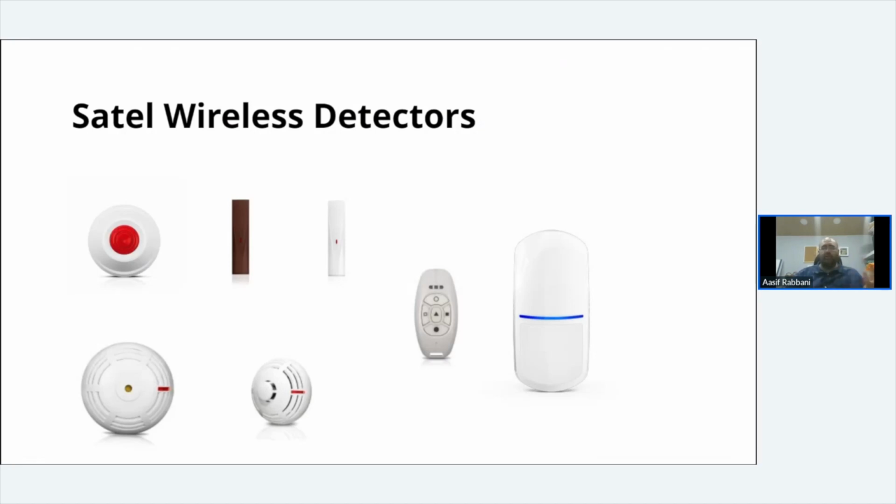So say, for example, you put in a Slimline pet and the customer kept having false alarms because it was in a room with a log burner or a heater or something that gave off heat after hours. Then you decide, I need to change it. Instead of changing the whole thing, you just change the inside. Take the insides out, put the new insides in, put your cables back in, boom, it works. It's like having a hot swappable hard drive on an NVR.